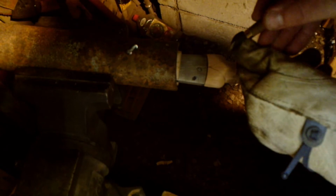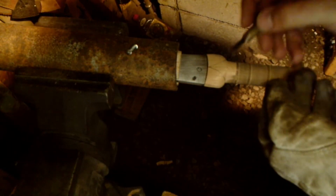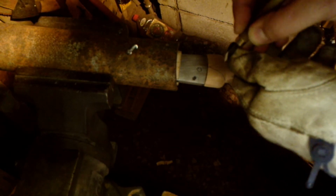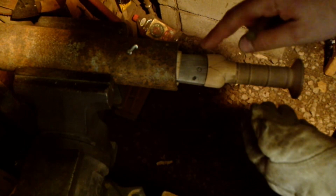because what I'll do is I'll stick it in and take behind the back side of the chisel, and with my thumb resting on my fingernail, I'll gently push that along. You don't have to go fast. You can take it easy, go real slow. Another way you can do it is just to simply push in, go up a fraction of an inch, push in, fraction of an inch, push in, until you've got your design outline.